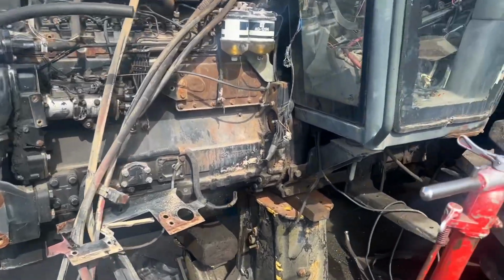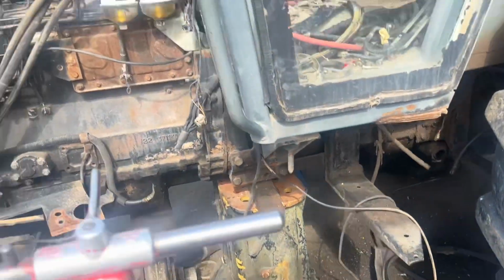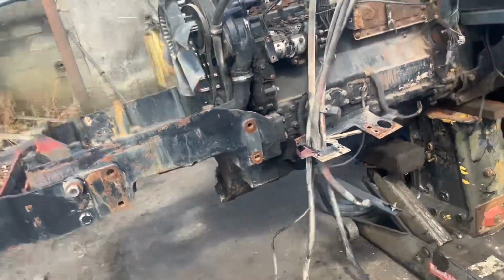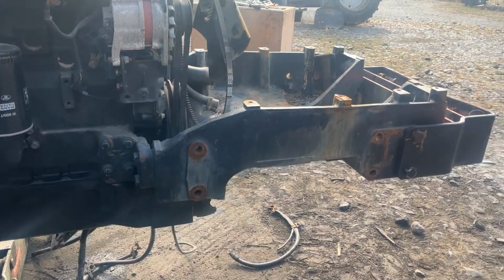Okay, so we've the axle stands taken out and an old gearbox housing taking the weight over now. So we're going to drop off this weight frame. We've the bolts cracked in this side, we'll just crack them this side now, and we can get the Manitou then and lift her down.